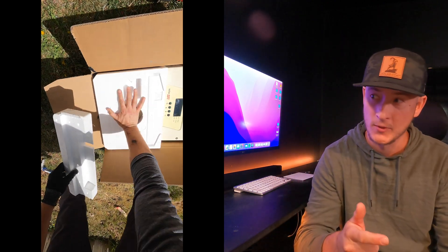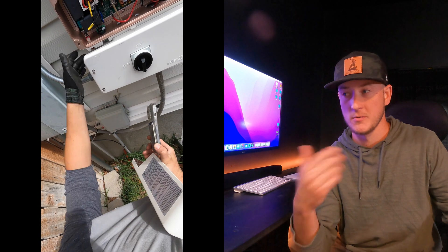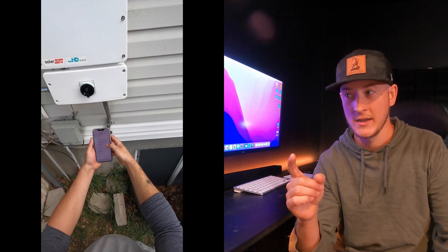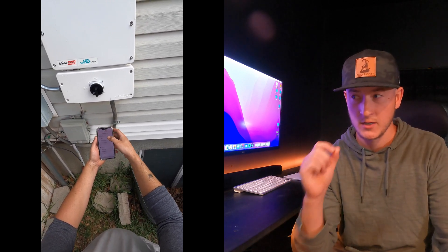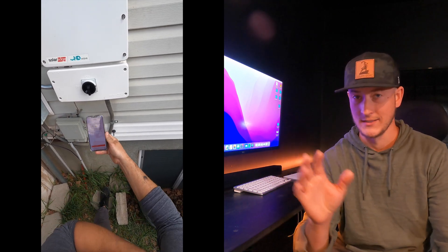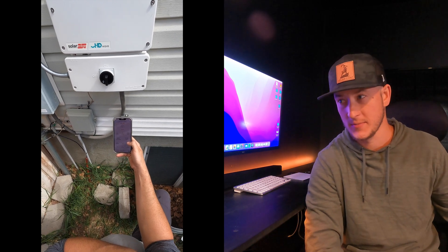Open up the setup app on your phone — it's going to load the latest software. Toggle the inverter to emit WiFi and connect to it. The first thing you want to do is go into pairing. Once it loads the software and DSP one and DSP two, click pairing, click continue and wait. It's going to do pairing and grid monitoring, and this is probably going to take about 10 minutes after it just took 10 minutes to do the software update.